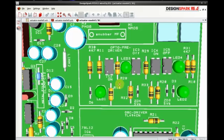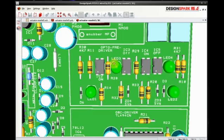Now the opto-isolator section, I've got some LEDs on here. The main purpose for the LEDs is because with the opto-isolators, you can't actually see what's going on with them, because they're encased inside a shell, and you can't see when the LEDs inside them are lit because they're infrared or something. So these LEDs are in series with the opto isolators, and they will light up when the opto isolator LEDs are lit up inside, so we can see what's happening. We can see when it's been activated.